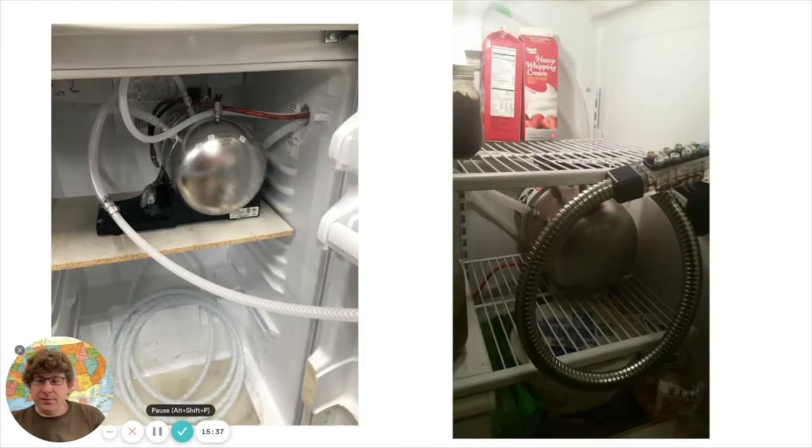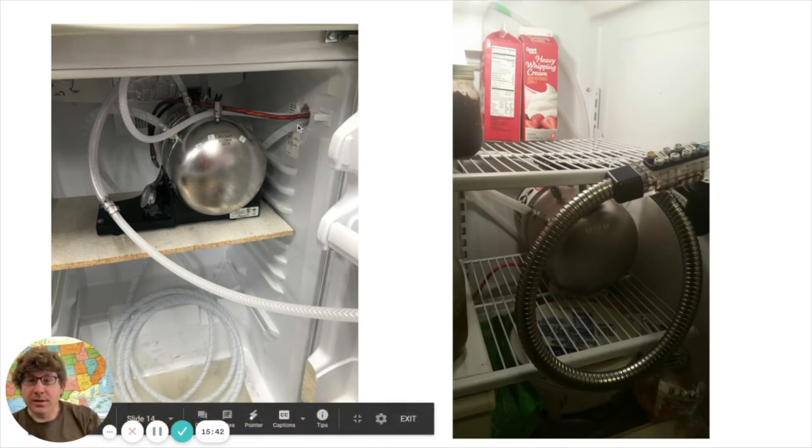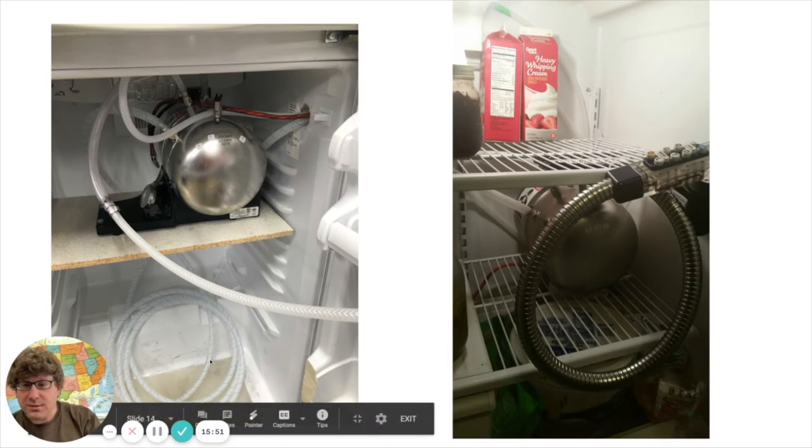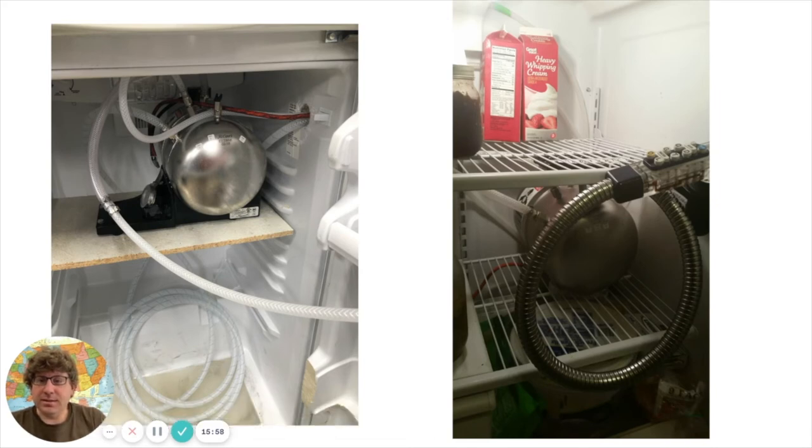Here you can see the first version of it, with the water coming in, the connector, and the carbonated water coming out, plus the CO2. I had originally designed a section down here to act as almost like a pre-chiller, but what I encountered was it started freezing because the diameter of the hose was so small. So I nixed that idea and just went straight in from then on.